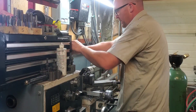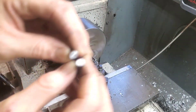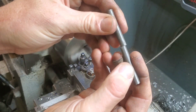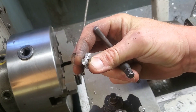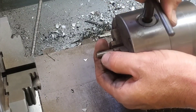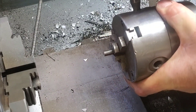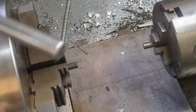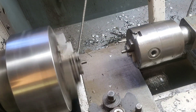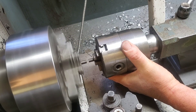The process is really simple, but there are a few key factors we need to come down to. You're going to need two mating surfaces, and in this experiment I did a mating surface that has a dimple in the middle on purpose. This will become very evident as I start to friction weld the two pieces together — you're going to see them start to walk around and dodge each other. The dimples aren't too big of a deal if it's really rigid, because eventually those two little dimples are going to wear off and it's actually going to lap the two faces even together.